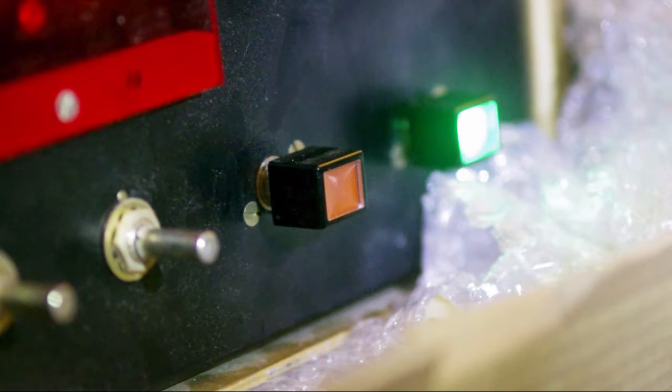While I've got this thing fired up, I'll just get a shot of a Nixie tube. This is a slightly special type, so you'll see. Okay, that's the Nixie, and what's special about this is that we're actually looking at the top of the tube right now. There's 6 Nixie digits that in total give you kilohertz adjustment up to 29.999 megahertz, 0.9. So it's 1 decimal point for 100 hertz tuning resolution.